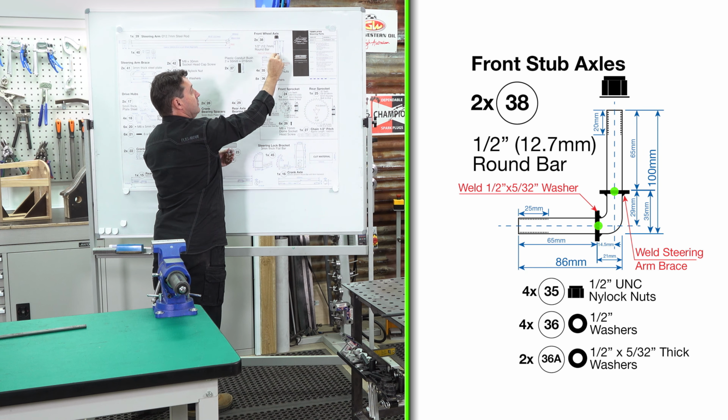We've just finished doing a pair in our manual bar bender, measured, cut. We've also tapered the face, ready for the die nut. We'll show you how to do it manually now in a vise. We insert 100 mil into the face of the vise, but we're using the aluminium magnetic jaws, which are already pre-cut for round bar or tube.